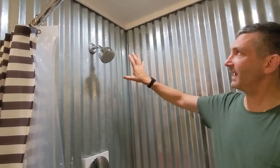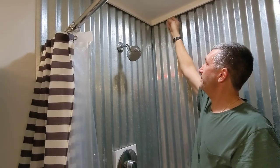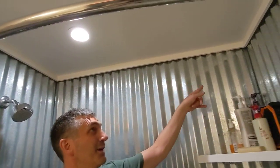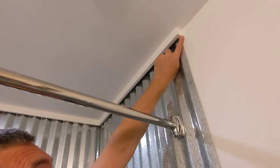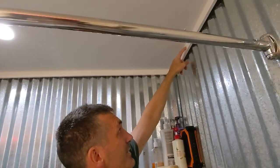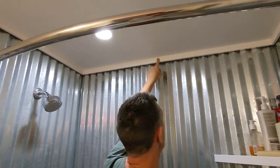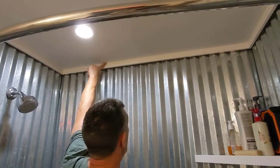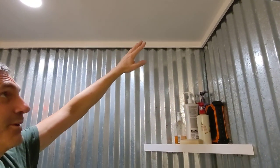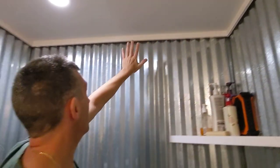This one I did really well — I did a nice decorative trim at the top. I glued this whole thing up with PVC cement in the workshop and brought it in as one big piece, including these little return stubs up here, all 45-degree mitered. Put it up here, and you can barely see a hint of finished nails where I shot with a finish nailer right through into the 2x4s. Then I caulked the top. In here are the foam strips — more decorative than the others. There's a nail pop in here from something, but that was it.